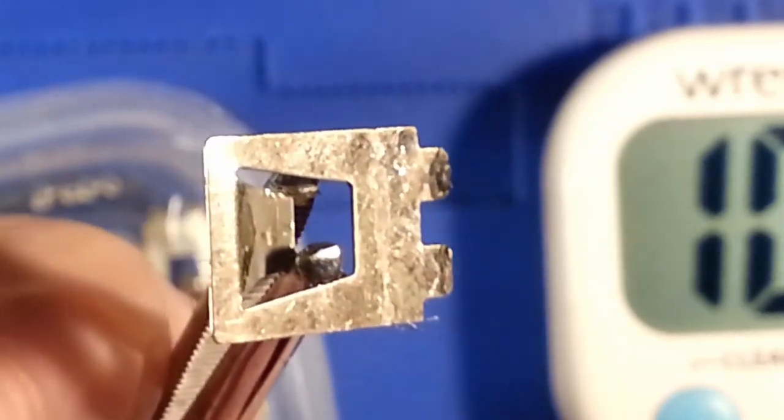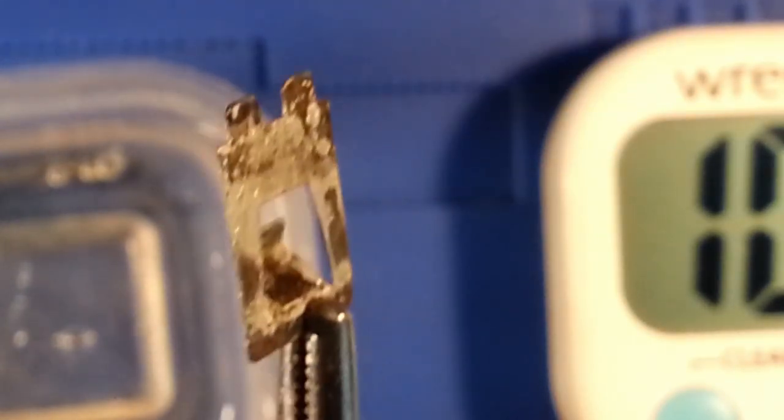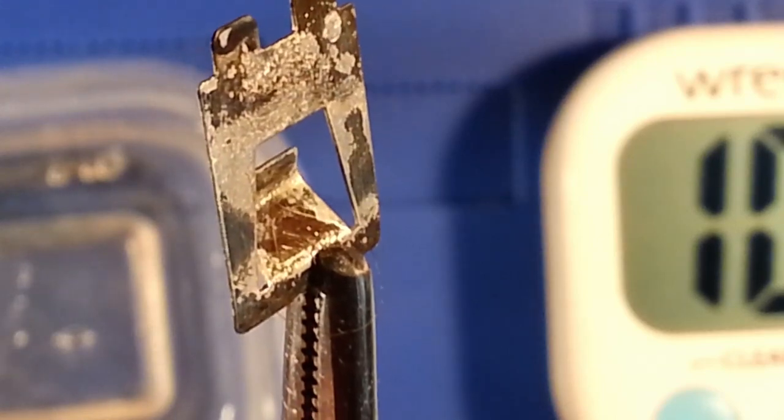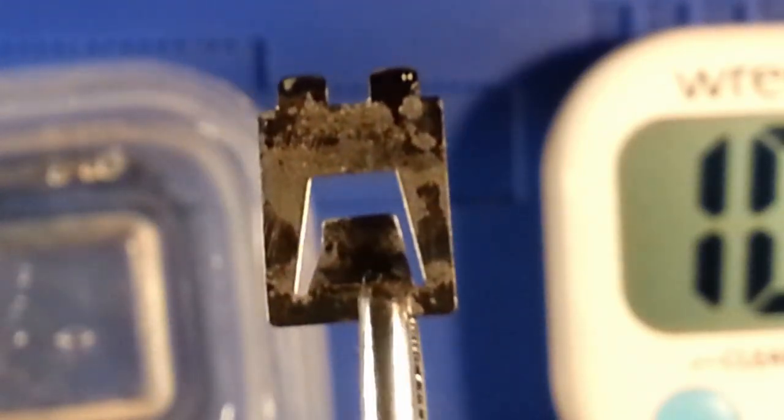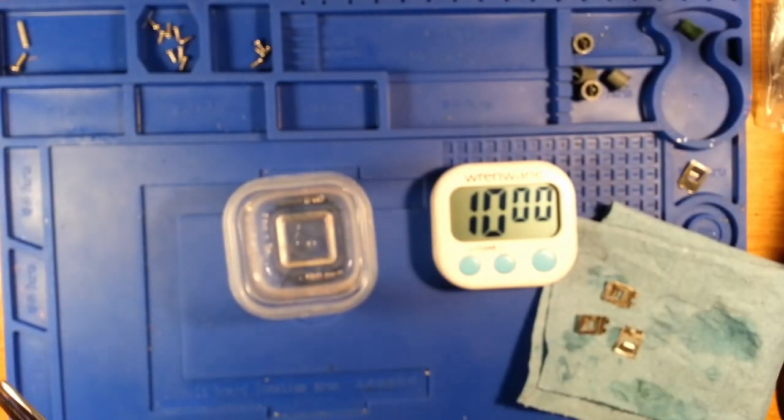The matte-looking, non-reflective surfaces are the parts that have been coated with the liquid tinning solution. And my main concern was just over time that they wouldn't have any corrosion from that bare copper or brass being exposed to oxygen and sulfur in the atmosphere. And it seems to have done its job. Granted, like I said, this is not a high-dollar piece of electronics equipment, but it's something that you'd still like to see working and functional.